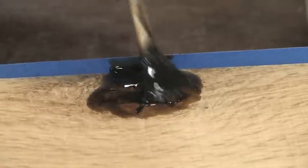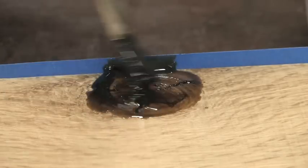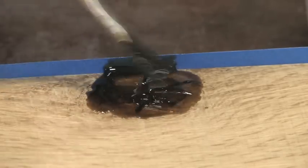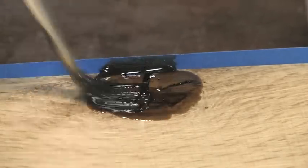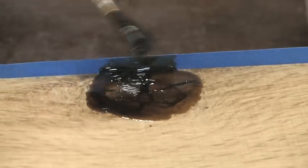This is the reason why we do this now — because all of this area around the knot, if we did that on the finished piece, it would stain it and create a problem when it comes time to finish. This way we'll plane all that material away and all that will be left is the epoxy that's in the cracks.